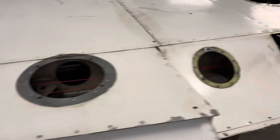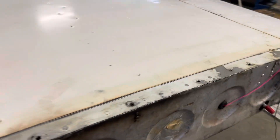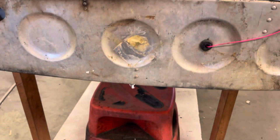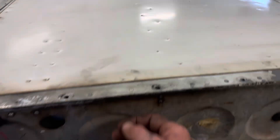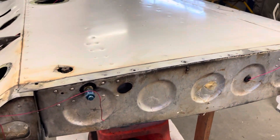Once the wings are paint stripped, it'll give us a better look for corrosion. I remember back when I was an apprentice I was sent to find corrosion on an A320 wing, and I pointed out bits of rust-looking stuff — but that's not what we're worried about. That's just corrosion inhibitor and dirt. What we are actually looking for, if I look under here — I gave it a bit of a blend earlier — is this sort of thing going in potentially underneath that rivet. We'll end up drilling that rivet out and getting sandpaper under there to make sure it doesn't spread.